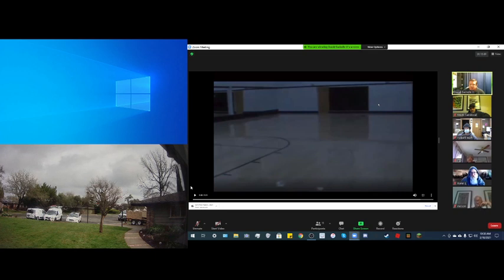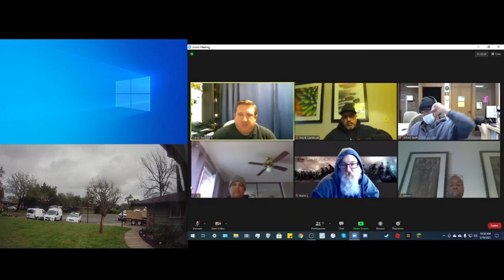What that does is creates little scratches and it roughs up the floor enough so that it now is going to accept a new coating. After that's done, they have to remove any excess. No dust can be on the floor, no excess water. You want that floor squeaky clean. You want to be able to run your hand over the surface of it and feel that it's just totally dry.